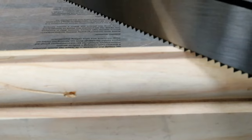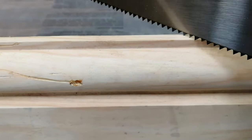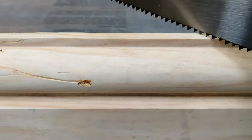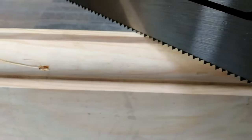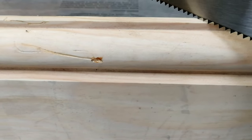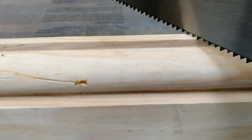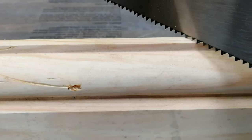You've just started doing this method, so you're going to try and keep the angle — if anything, make it slightly bigger or smaller. Because at the end of the day, when this fits, all you're going to see is the front edge, not the back edge. If you make the angle too shallow, the back of the joint will touch and you'll have a gap at the front.